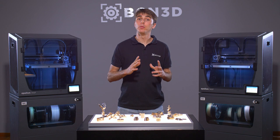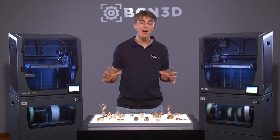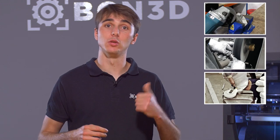Since these metal printed pieces can be treated in the same manner as steel manufactured parts, you have a wide range of possibilities to improve the finish of your model. You are free to remove supports by cutting, you can polish the model, you can join and repair pieces by soldering, as well as drill, bore, and you can even thread holes.